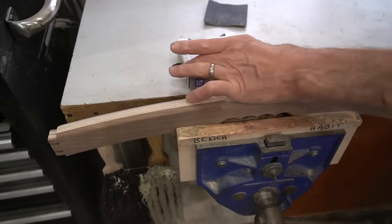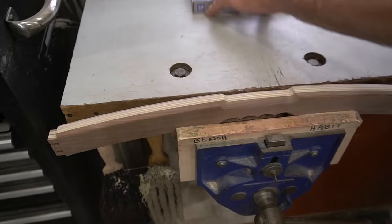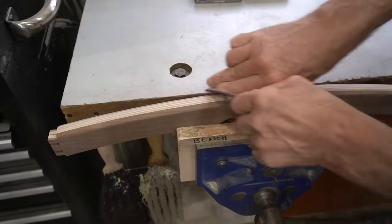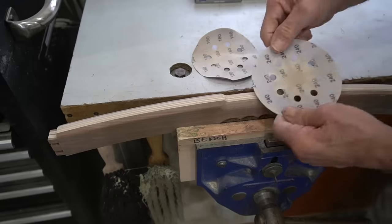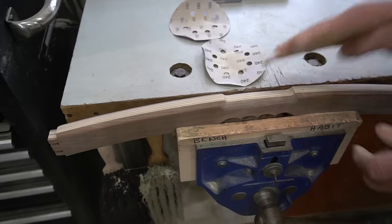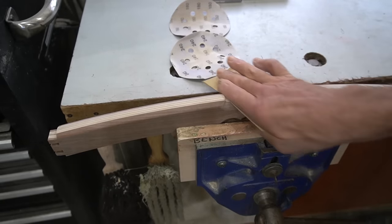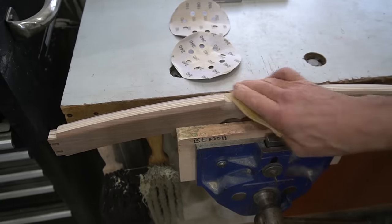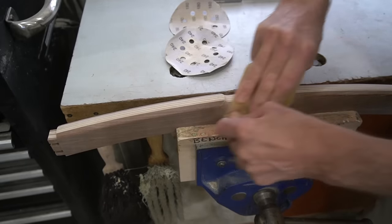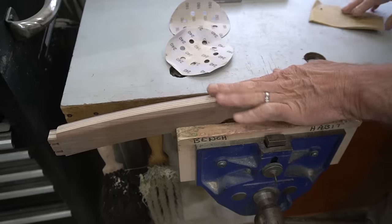And the only drawback is that John sent me only two grits, 120 grit and 400 grit, for beta testing, so I've got to do the intermediate grit stage sanding with partially spent special grit discs from Starbond. But because the initial stages of sanding go quick and easy, it's also quick and easy to follow up with the finer grits through 320 grit to finish up initial sanding of these handles before glue up.